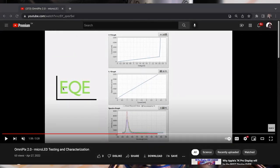The difference between PL and EL in terms of accuracy for identifying defects can be anywhere between 30 and 40 percent — it's considerable. PL is much faster because there's no contact. EL is slower because you're going point by point, touching each one. It's a much more accurate way of testing but unrealistic at the scale of micro LED wafers. One area we're putting a lot of effort into is a rapid EL technology that will allow a full wafer test of around four million points in about half an hour to an hour — compared to five to six months today.